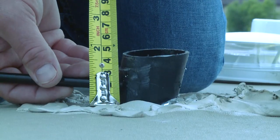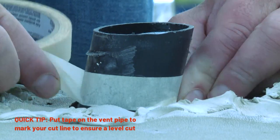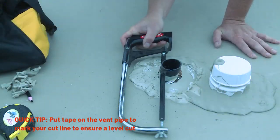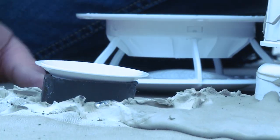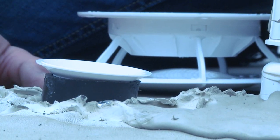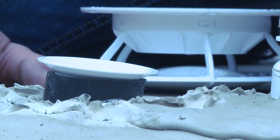Once you have removed all that you can, cut the vent pipe to the preferred 5-8 inch height above the rubber roof so the 360 siphon will fit securely. Next, push the 360 siphon water collar into the vent stack, ensuring that it's in far enough to allow the siphon base to sit flush on the rooftop.